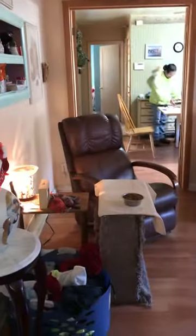You can see the shut-off for the gas. The line set is actually running up through the ceiling space — it's roughly about a 12-foot run to the back of the house, so probably about 12 to 15 feet, and by the time we get down we'll probably need about 20 to 30 feet of line set. The customer said he's pretty certain there is a leak in the line set, so we're going to replace it. To get in, there's an access point in a bedroom at the front of the house.